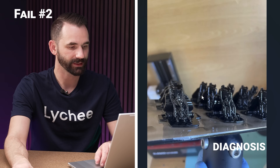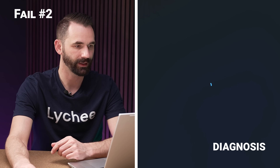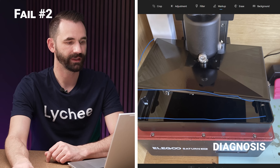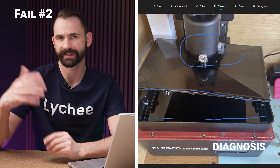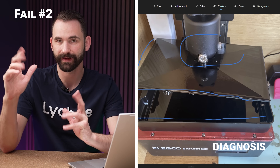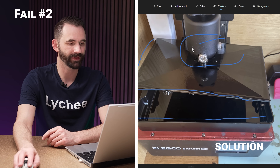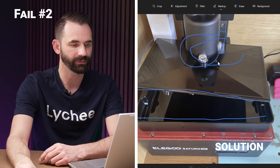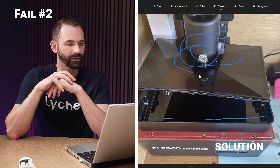Because this is across the entire build plate and not just an isolated spot — which would suggest a resin leak blocking UV light — it tells me the build plate is not working properly. Looking at the build plate, it shouldn't look like that; it should be straight. This ball joint right here is not tight or it has failed. I had lots of issues with my Saturn 1 ball joint over time just giving out and not staying tight. Probably what I would do is try tightening it all the way; if it's still happening, reach out to Elegoo. Buy another build plate to strengthen it back up, because wobbling like that will never produce a good print.